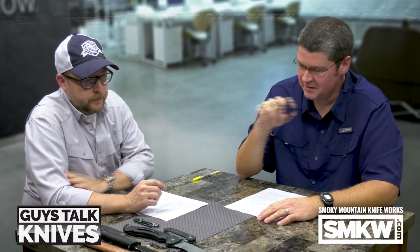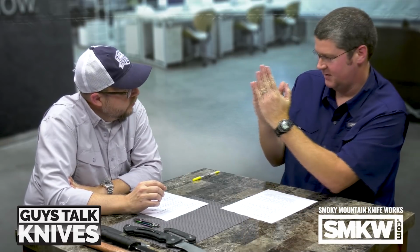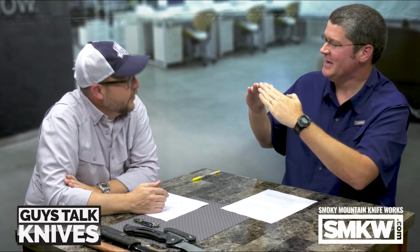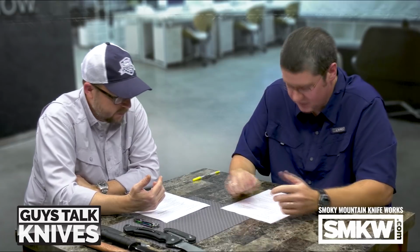And then one other thing to look at on this is, depending on the thickness of your blade, I call it the paradox of the edge. So the tighter you make that angle, to be very, very thin like the hollow ground, you can get it extremely sharp. It's really sharp, for a couple of cuts, and then it dulls out. Or you get an axe, which is very strong. So I'm not going to slice this paper with that. I'm going to get it sharp on the edge, but then I can't push it through as easily as something that finds the right angle. Okay. So that's kind of what you have to think about when you're sharpening these.